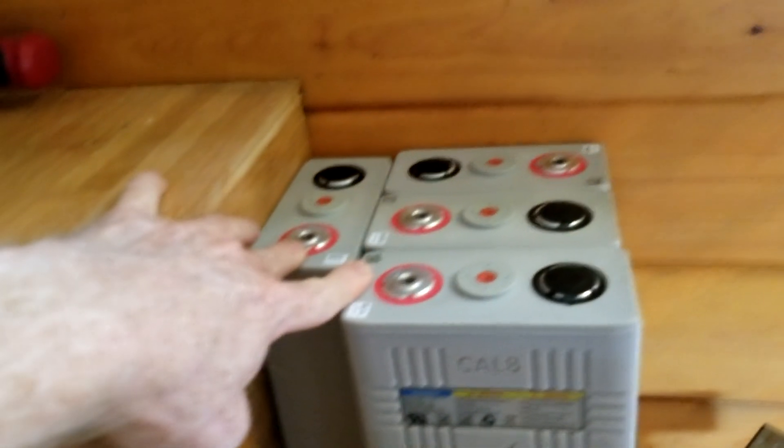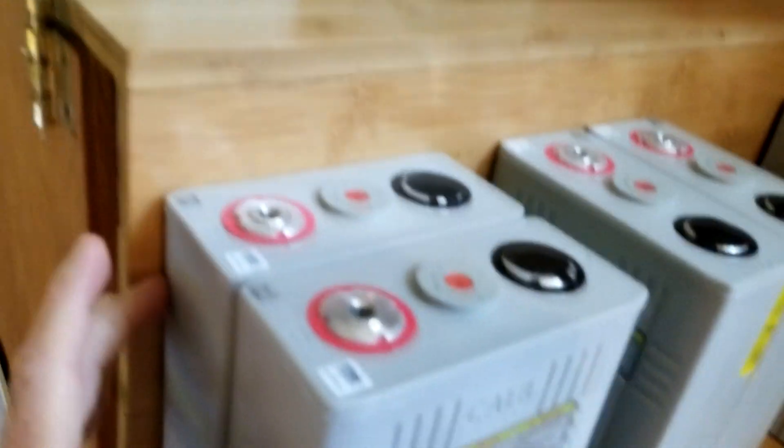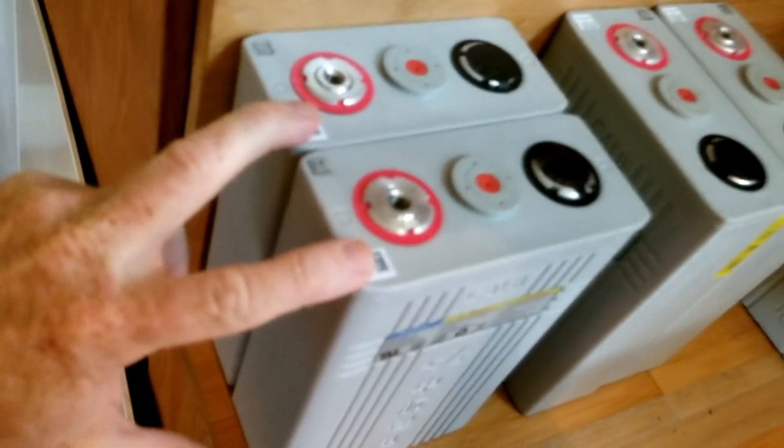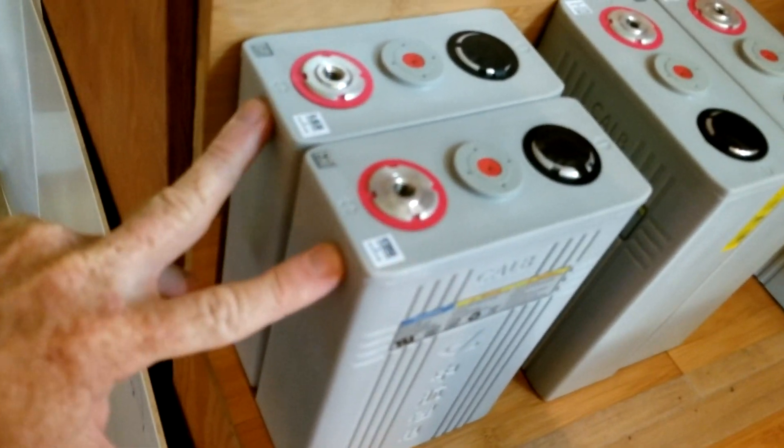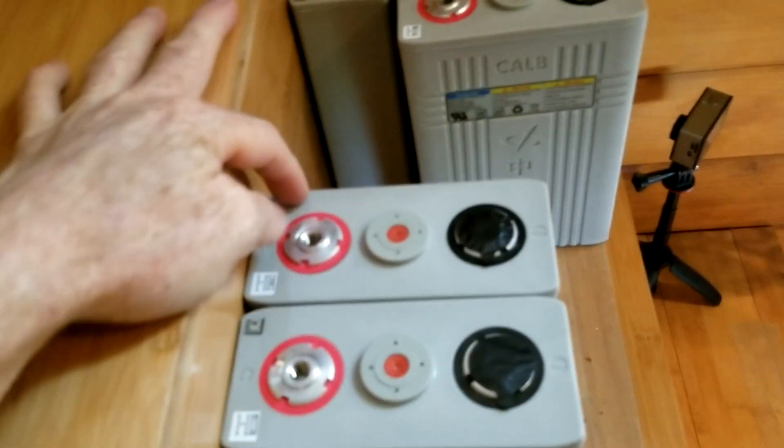Then I've got another cluster of four right here. I'm assuming in the other missing box — it's supposed to come tomorrow — I will have the two numbers that match these or are in sequence, and same thing on these. The numbers are out of order right now, but I think it'll all come together tomorrow. These 16 cells are going to become clusters of four. Pairs of cells will act as a single cell because I'll run them in parallel, and then I'm doing a serial string and then parallel again.